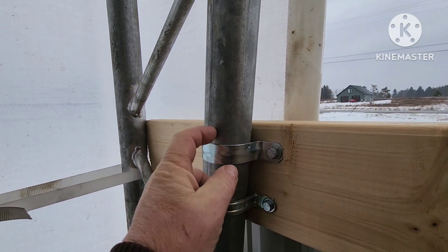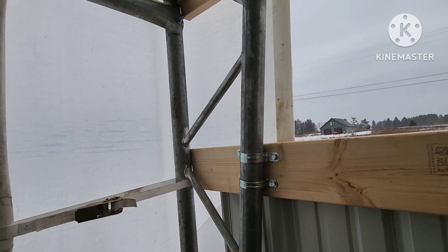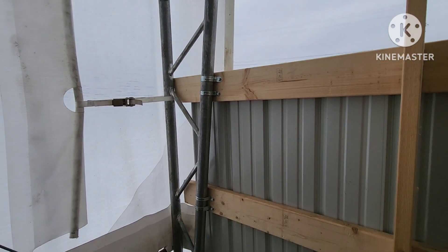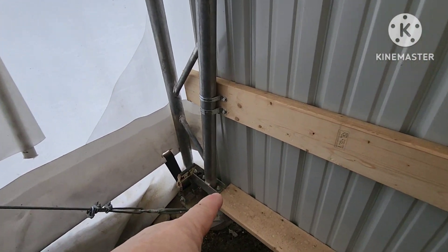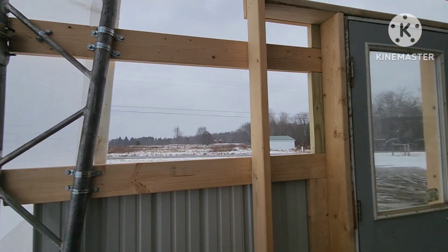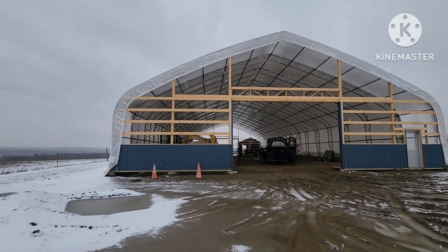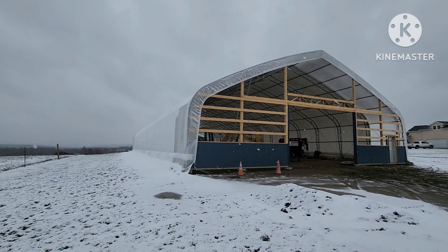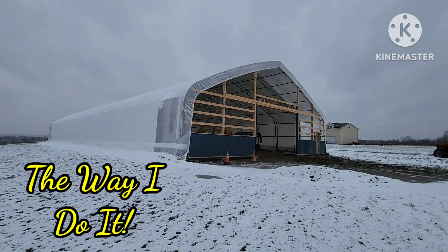On this end, what I did with my girts is I used two-inch rigid conduit straps. I just attached them with lag screws and because it was new wood, the lag screws drilled right in. I think that's a good way to do it. The company said you could just drill right into the steel, and of course they're Amish so I don't know if they talked to an engineer, but I just don't like the idea of drilling into the steel. I prefer not to perforate it because that causes a stress riser and also allows moisture in. I felt this was a better way to do it. So this is my fabric tension building — 60 by 150 feet, built in New York state by the Pennsylvania border in the western part of the state. If you have any questions, post them below and I'll respond. Thanks for watching. That's the way I do it.